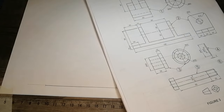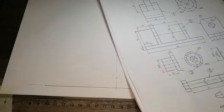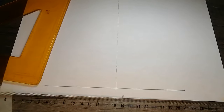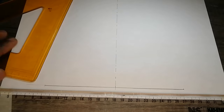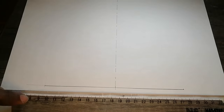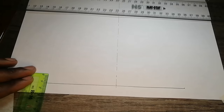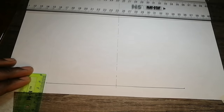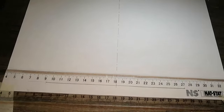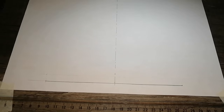From here going up is 10mm, which means from here going up 10mm — your T-square is always here. I firstly draw it faint because I don't know how long that 10mm would be. Now I come to say this is my 10mm. After drawing that 10mm, I can draw a faint line. Then I come to this side and draw a dark line.